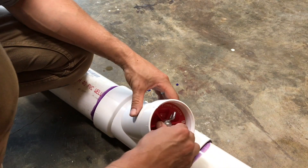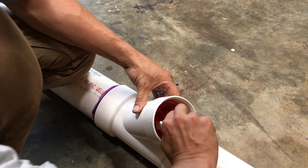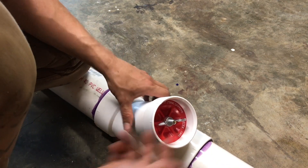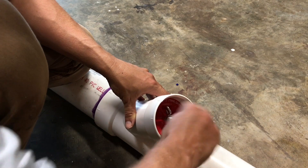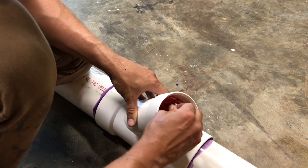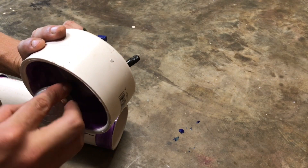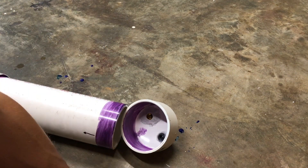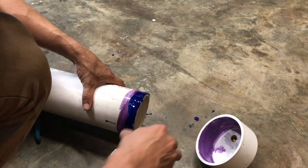Take your check valve and dry fit it down. When you screw it clockwise, it pushes a rubber gasket outward and gives you a good airtight seal. This inlet is going to serve as our water intake valve — this is where we're going to fill up our solar shower from. We'll be able to remove and replace the cap at will and refill using this clean-out sweep. You can use a straight 90-degree T if you can find one, but I prefer the 45-degree sweep. I went from a 4-inch sweep on both ends to a 3-inch on top for the check valve, since check valves are a little cheaper the smaller you go.